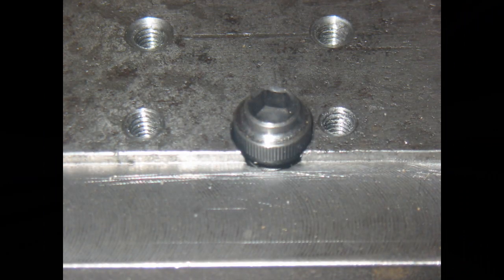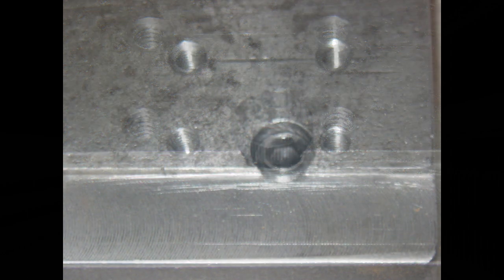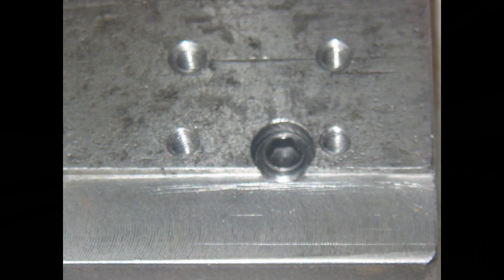Here's a good example of the kind of pitfalls you can encounter when you're working on the fly. I had to machine off a little bit of the head of that cap screw to clear the dado feature for the blade registration. I could have moved that cap screw back 7/8 of an inch instead of 3/4 inch from the end of the register bar underneath, or I could have brought the cap screw in from the bottom. Either of those methods would have worked.